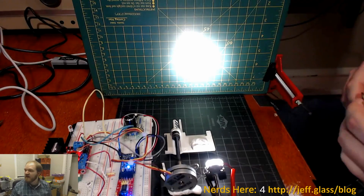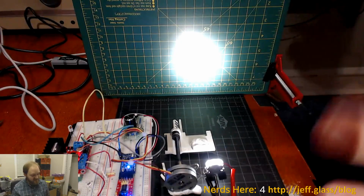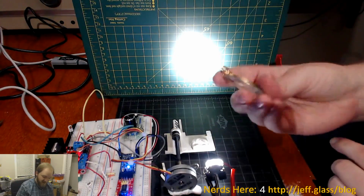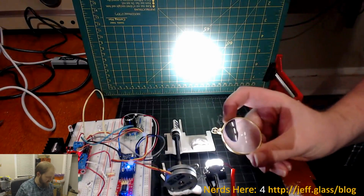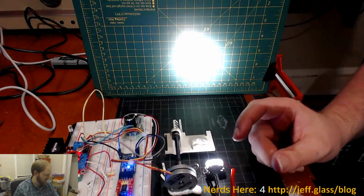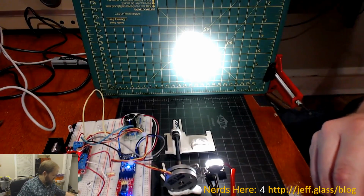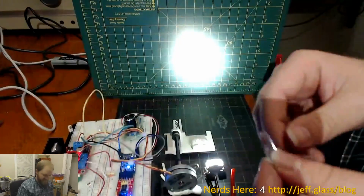Well, what do you think? I think the winner was Granny Lens. In terms of, let me define our terms. I think if we're looking for a wash moving light fixture that zooms for some reasonable amount of zoom, the large lens of the Granny Lens is more potent than the 6, the 10, the 15 degree magnification lenses. Let me remind myself what that 6 looked like. Oh yeah, the 6 was the one we could get all the way out. The 6 was this little tiny one.